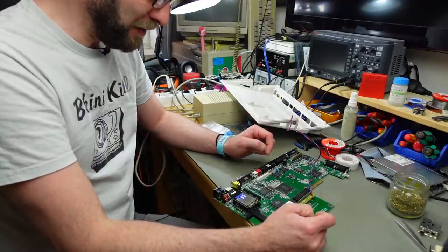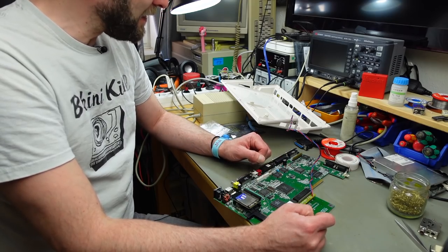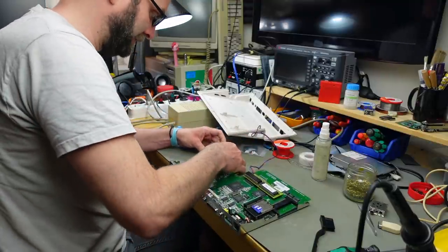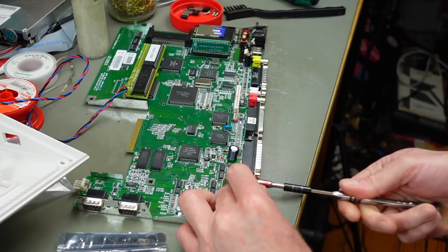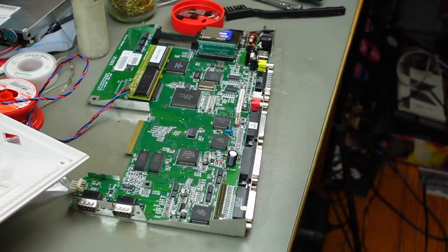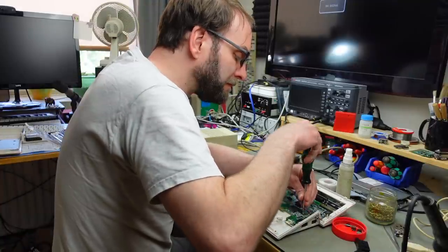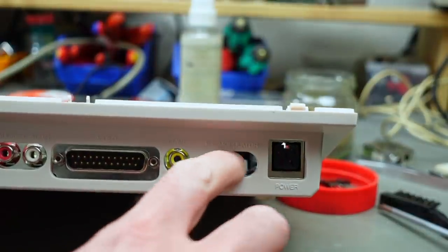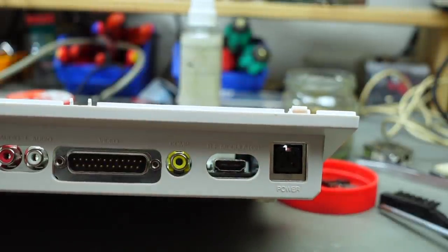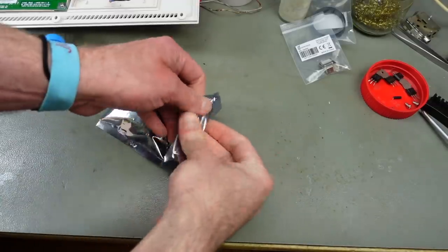The first thing I want to do is put the shielding back on because we have to mount the Raspberry Pi and the actual RGB to HDMI adapter in the case. Then I'm going to slide it back into the bottom case since we don't need to access anything on the bottom of the board anymore. As you can see, our HDMI port lines up nicely so we should be able to fit even the bigger HDMI connectors in there. It still says 'RF modulator' but yeah, it isn't.